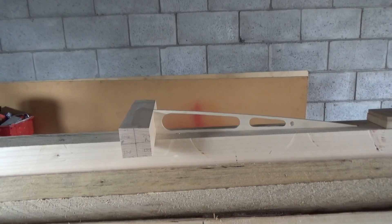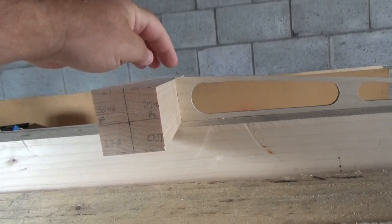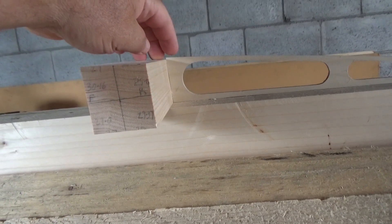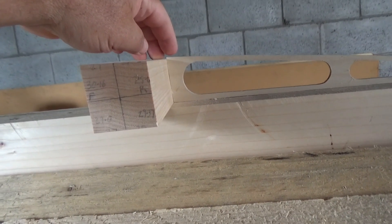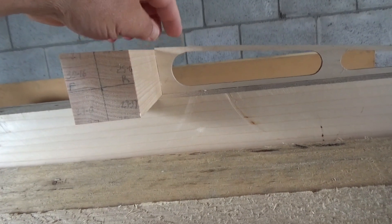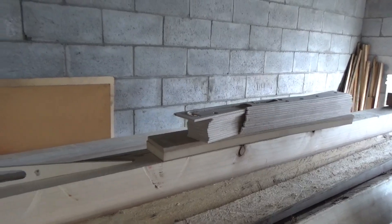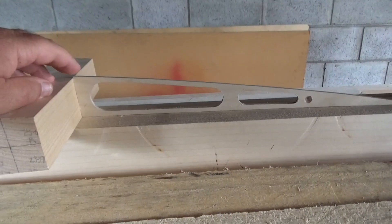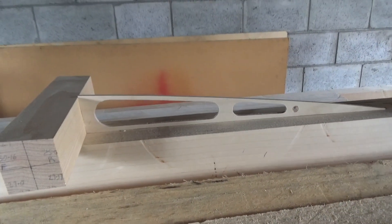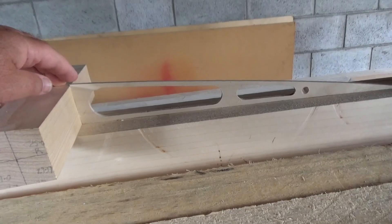You can see there the trailing edge web rib, and it's now sitting about right at the top. What I found is this vertical dimension on the web rib was out by about 1/32nd. It was quite small. So I changed the template I used for making these and rerouted all of my tail webs — that's that stack there. I also had a go at using my new lightning hole template to route out the lightning holes in the process. Because I basically developed that whilst this was oversized, in the process found it's not going to work. So I need to restart that.